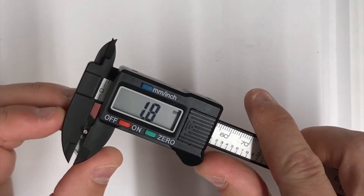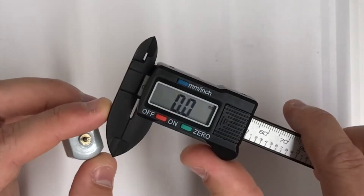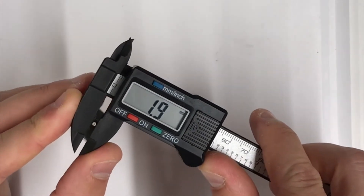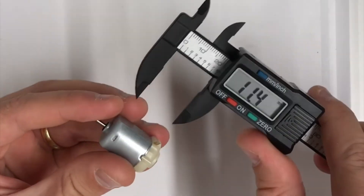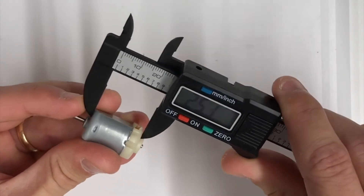You will see the digital calipers fluctuating a little bit, and I take the measurement a second time just to be really clear and to be sure that I'm getting an accurate measurement. Our 3D print will need to be slightly larger than this, so we'll be setting the bore of our gear to about 2.1 mm when we get there.